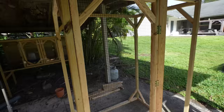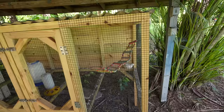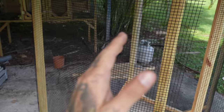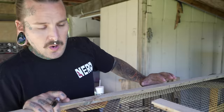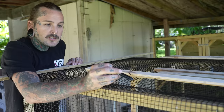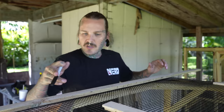Looking real nice. We're putting some on the inside, and the rest of the chicken wire I'm doing differently — wrapping it around the outside. Normally I would do it in panels, but because I have really expensive lizards going in these cages I want it more secure. This wrapping method is the first time I'm trying it instead of doing panels. Not the most perfect thing — it has a few bows to it — but now as an added preventative, I'm sandwiching the chicken wire between the framing and half-inch wood trim secured with drywall screws, so this thing is gonna be solid.